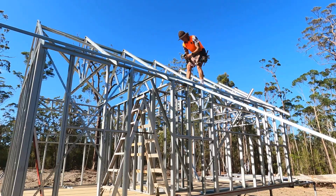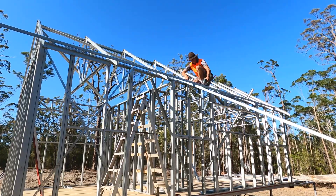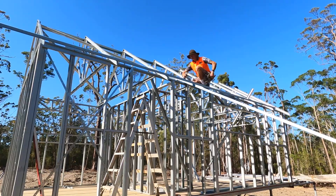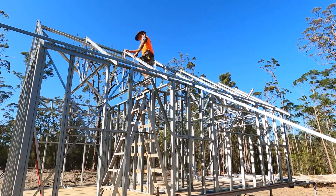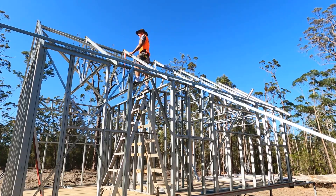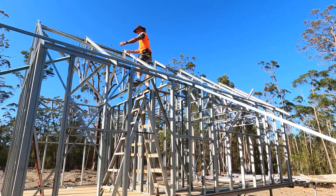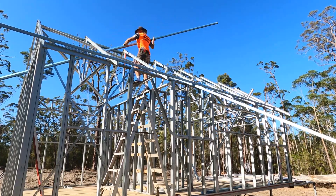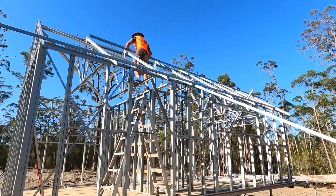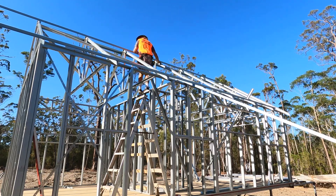When you're doing the top batten, you need to work out how wide your ridge cap is from centre and where you want that screw line to land, so you've got that top batten in the right spot — you don't just bang it up anywhere. It's also very important to have your roof battens nice and straight and running parallel with each other, because your roof iron gets screwed down to these battens. It defines where your screw lines go, and you can pick it if your screw lines are all wavy or out of parallel.